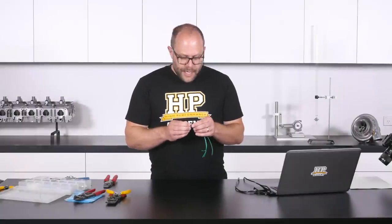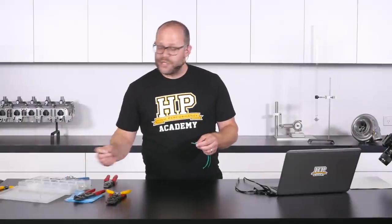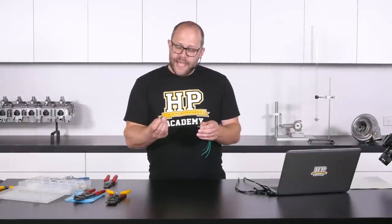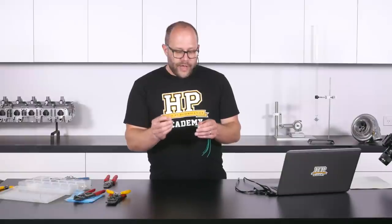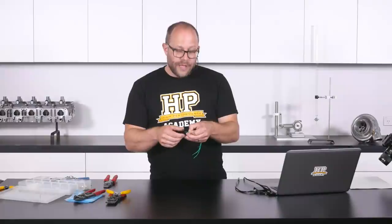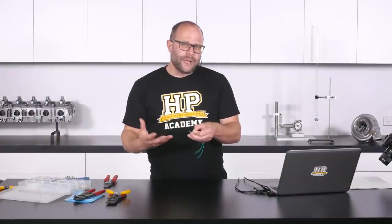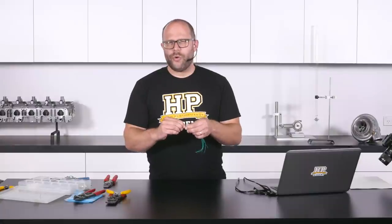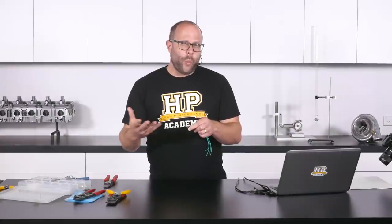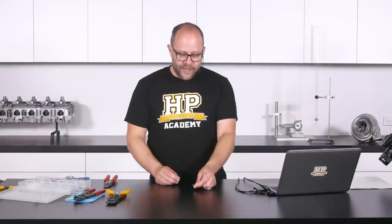Looking at the details of this crimp join, you can see the open barrel splice has been really nicely and evenly folded over. On either end of the splice we've actually got a little bit of a bell mouth as well — that's an artefact of the shape of the dies on that tool, and it's really important as it softens the transition between our splice join and our stranded copper, helping reduce any possible fatigue cracking. We can see our copper conductor strands protruding from the end, which is a good way to do a visual inspection to make sure we had all of those wires in there. What we would do now is take a section of Raychem SCL heat shrink, shrink that down onto this piece of harness, and close off the end with some flat nose pliers to electrically insulate this splice join from any other wires or connector body it could short out on.